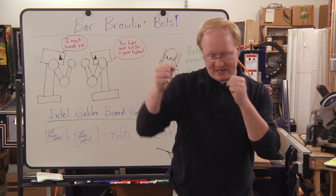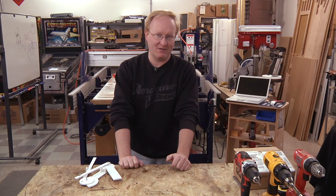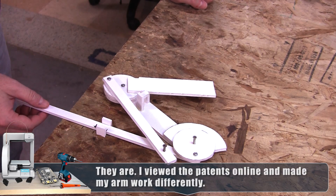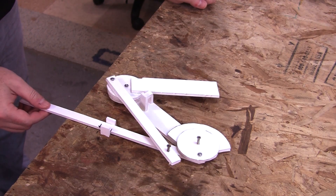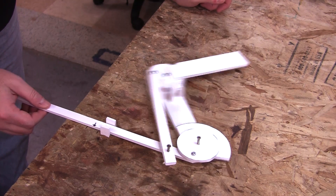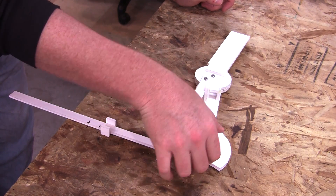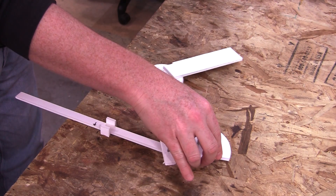To start, we need to think about how to make the robots punch, which is going to be a mechanical arm motion. So let's mock something up with foam. This project is inspired by Rock'em Sock'em robots, but we don't want to make it exactly the same way — it's probably patented. So here's what I came up with: you've got your boxing arms in a defensive stance, then you've got your punch stance. This will either have a linear actuator or we can put a servo right here on the shoulder. We have two end stops built into the robot arms — one for the punch and one for the guard. If this goes past the 50% point, it won't retract correctly. We only need about three-quarters of an inch of travel.